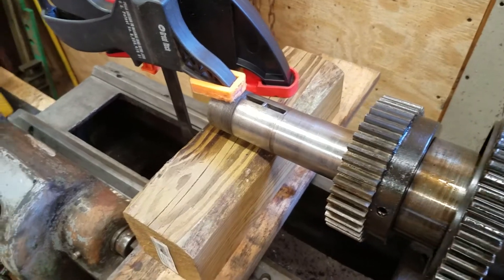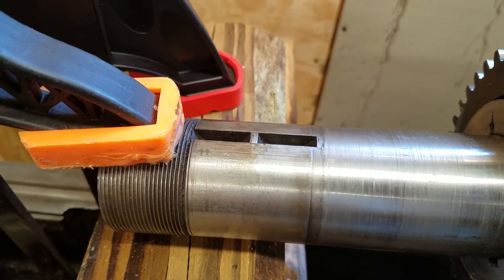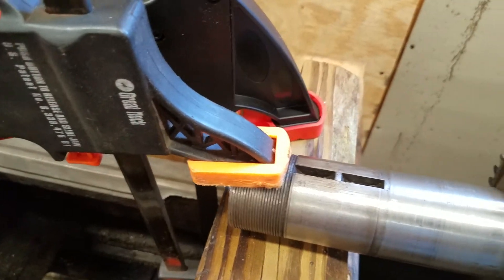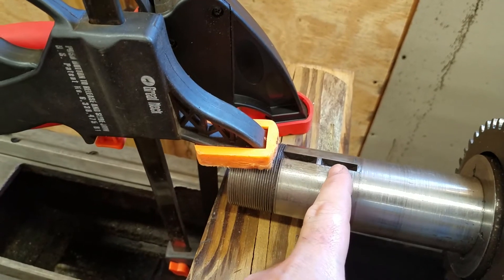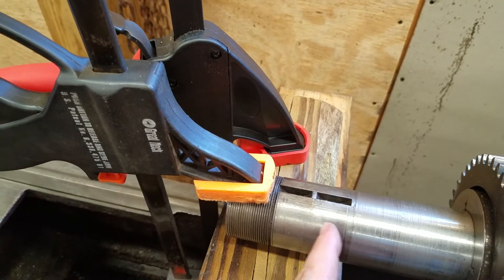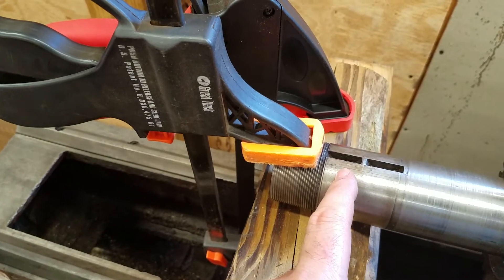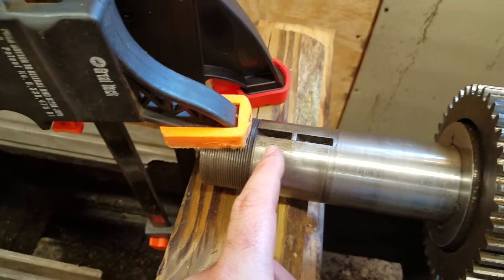I figured out how to do this. There are two woodruff keys that go on this spindle shaft for this old lathe. The one I was able to pry out because I could pry it against its neighbor position right here — pulled it out using a flat screwdriver, very simple. The other one was boogered and absolutely stuck.